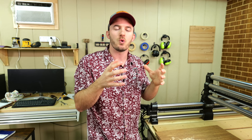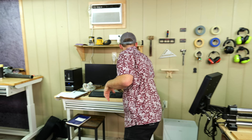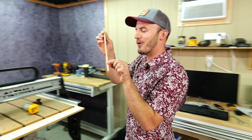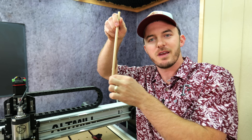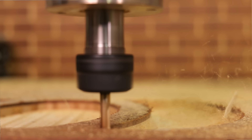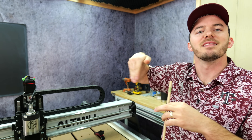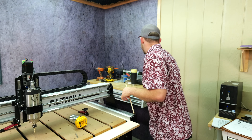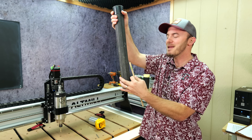The vibration side is very tricky, and that's when we start talking about machine rigidity and bit deflection. The simplest way I can explain bit deflection is this straw right here. These bits do have a little bit of movement in them — whenever they're cutting, a very small bit is going to bend like this and kind of snap every time it cuts. Doing this super fast is going to cause lots of vibrations — that's when it starts screaming at you. A bigger bit, like this giant straw, won't move as much. A bigger bit is going to have less deflection than a smaller bit.